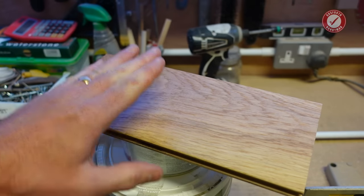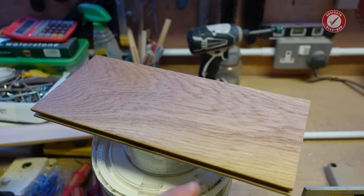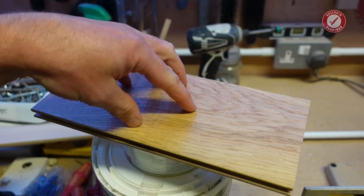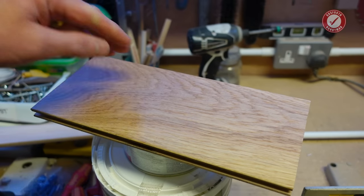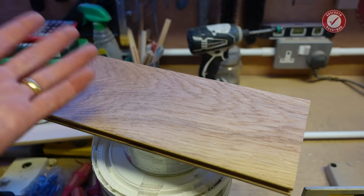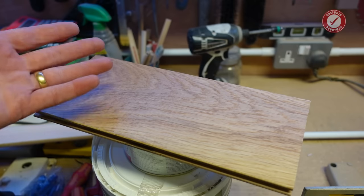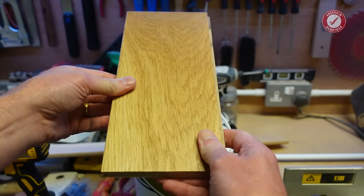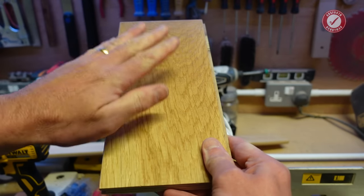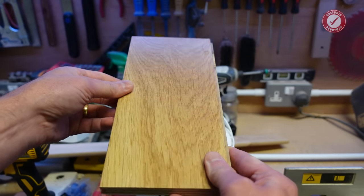The other thing worth mentioning is that this floor is fully pre-sealed, so really there's not an opportunity for moisture to get in from the top. All of the edges are fully glued, so any moisture that's going to get into this wood is going to happen over a very, very long period of time. That's going to massively slow down the penetration of any humidity in the atmosphere. And because we monitor the temperature and humidity and log it over a long period of time, I can kind of predict whether or not there's going to be a problem before it even happens. As a result, engineered flooring is very stable, and although they recommend the 12mm gap all the way around the room, I've just simply never seen it move.